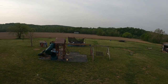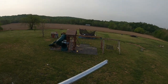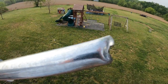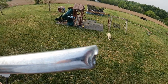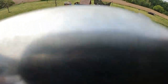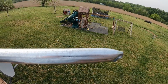I've already pulled the one that snapped off and I'm going to use it to see exactly what size I need. I've got this pipe here - you can see how the end where it snapped is kind of mangled. I'll use a hacksaw, angle grinder, or in my case a Sawzall, to cut it off where it's mangled. That way I can take this pipe with me to the hardware store to see what I need.